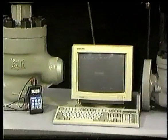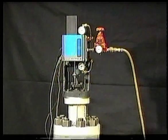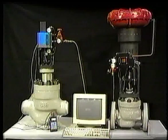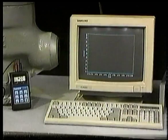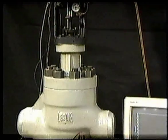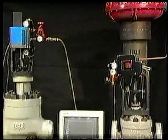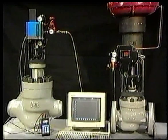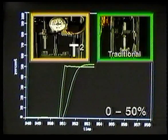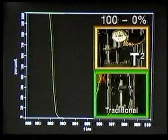To the left is an Aeroflow T2 high-gain valve, configured to give precision 20 to 100 times greater, while providing the potential for speed nearly 20 times faster, without compromising accuracy and stability. Both valves are set to run off of a 4 to 20 milliamp signal to show a comparison of response characteristics. The Aeroflow gives 4 to 20 milliamp feedback inherently, while the traditional valve requires a separate electrical position transducer. The position of both valves are being instantaneously captured on a computer monitor. We are now going through a series of 4 to 12 to 20 milliamp step changes to show a comparison of response characteristics.